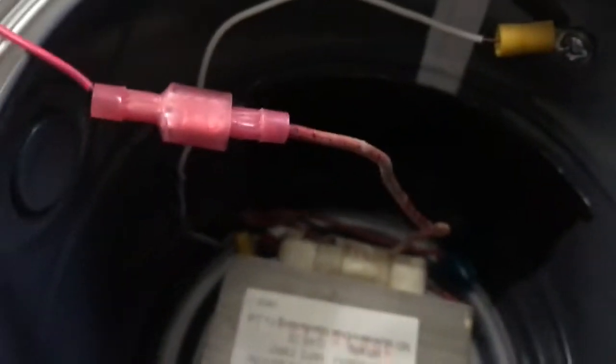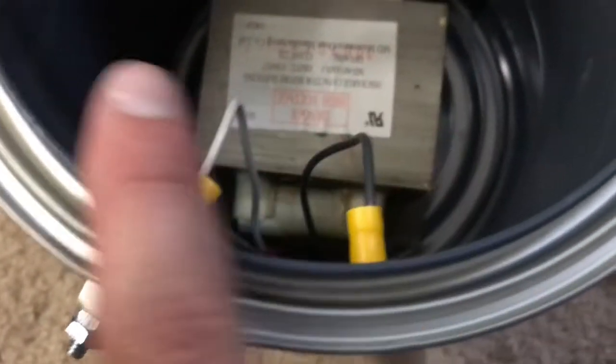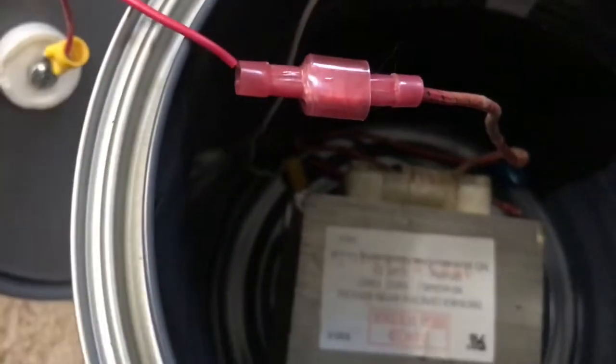Now the only thing left to do is to put some oil in. I'm going to leave the 3V windings in there — maybe I'll put an external 3V lamp on it. Some transformers do have a load indicating lamp on them; it's a very old thing. X1, X2, ground. I tried to tighten them down as best as I could because there was no sealant in there. Put some oil in there — let's see what happens.